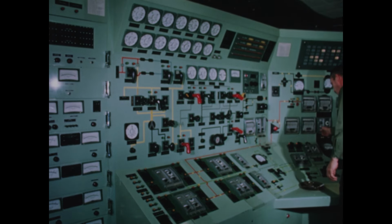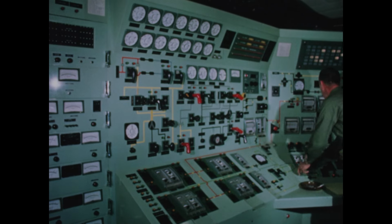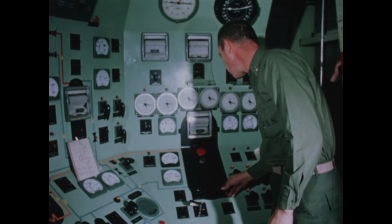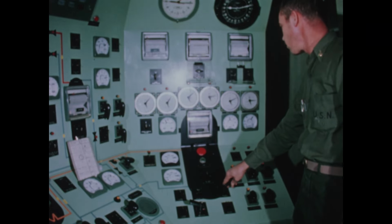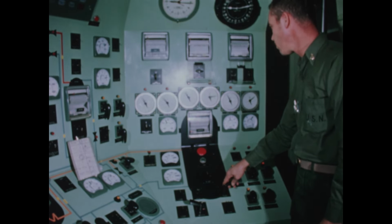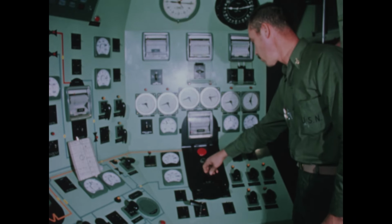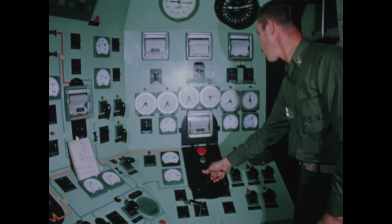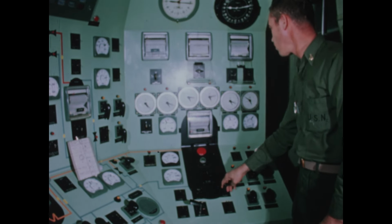To shut down the reactor, with rod selector switch in the all position and speed selector in slow, operate rod motion control switch to the in position. Adjust individual rods to maintain rod position within 1/2 inch of each other. Should a low pressure annunciator alarm be received, place the low pressure scram bypass switch in bypass to continue with an orderly shutdown.